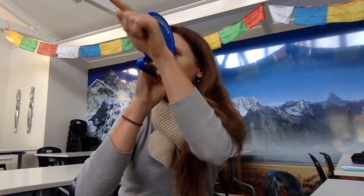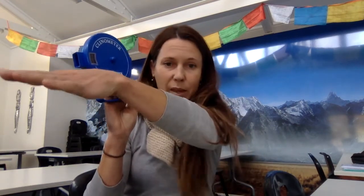A clinometer is a really handy tool for measuring angles of elevation and depression, and you do this by just looking through them. There's a little scale inside — you look through one end and it has a little window where you can line up something in the distance. You line it up with the little crosshairs and you can see numbers showing exactly how many degrees you're looking through compared with horizontal.